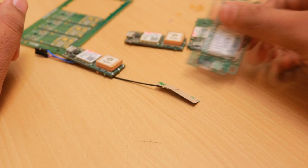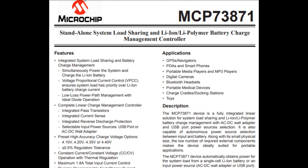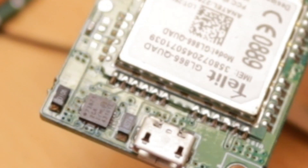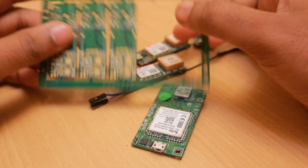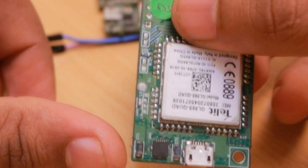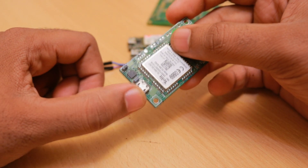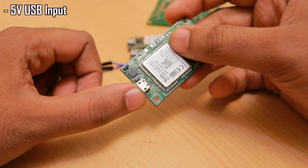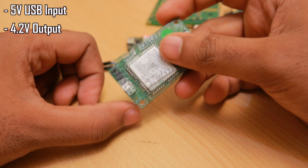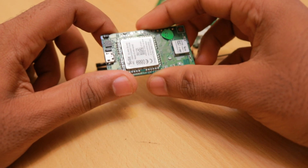The next design mistake I made is the selection of this Microchip part, the MCP73871. This chip is a linear battery charger, meaning it doesn't have a switching section and doesn't need any inductors. The other two parts we talked about needed a switching inductor for operation. Because this chip doesn't need any inductor I was using it on almost all of my designs. This charger chip has similar features — it takes up to 5 volts USB input and gives out the 4.2 volts needed for the circuitry.